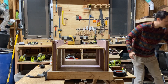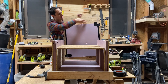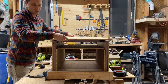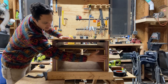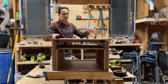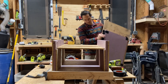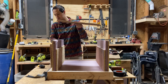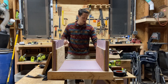I've also made the top. I've got to get a little more insulation to finish it, but this is the top — I put insulation right in the middle and I'll put another strip on tomorrow. The top has an overhang of about two and a half inches so I can slide in the end panels and secure them. It's just a half-inch piece of plywood with insulation attached using double-sided tape on the sides. Next steps: get more insulation to finish the top and more OSB to finish the side portions.